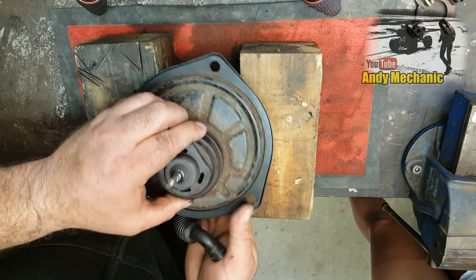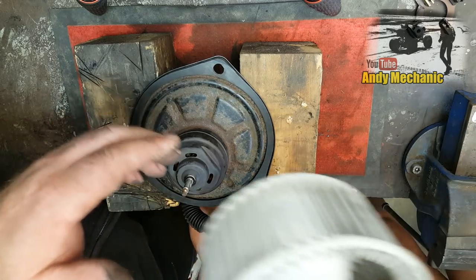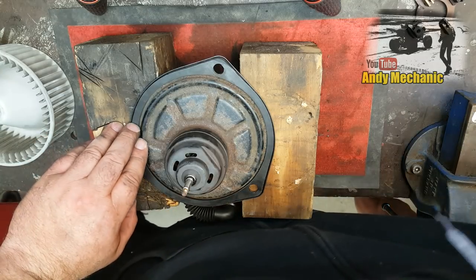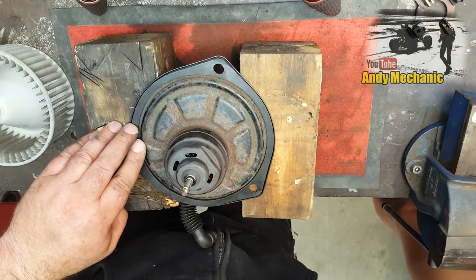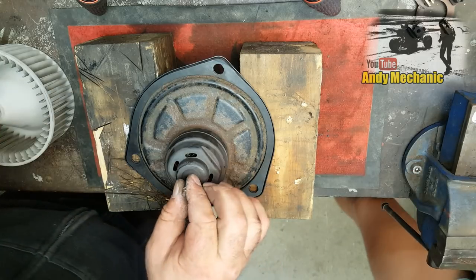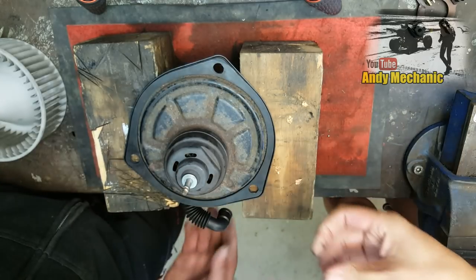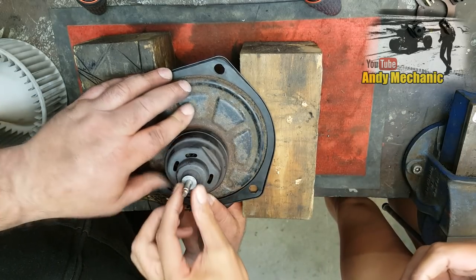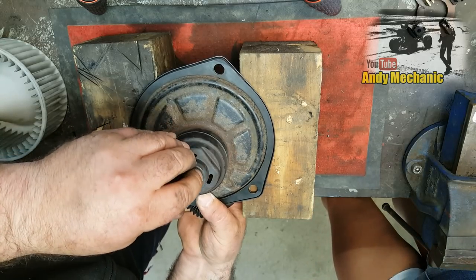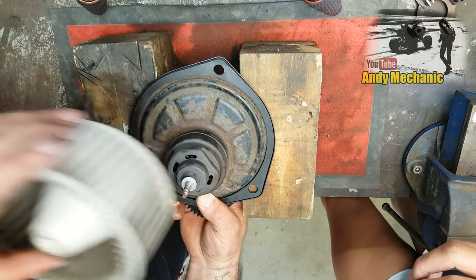And now you can grab the fan blades. Now we had a washer first, remember? Put them in the little tray there, look. The magnetic tray that clamps itself to the bench. Oh, it does, look at that. So that's the washer on there first. Yep. That should go all the way down. Now I've got to hold that armature up, because we're going to be pushing down a bit in a minute, aren't we? It's the only washer that came off, isn't it? Yeah, it is. Right, so we'll pop that on there.